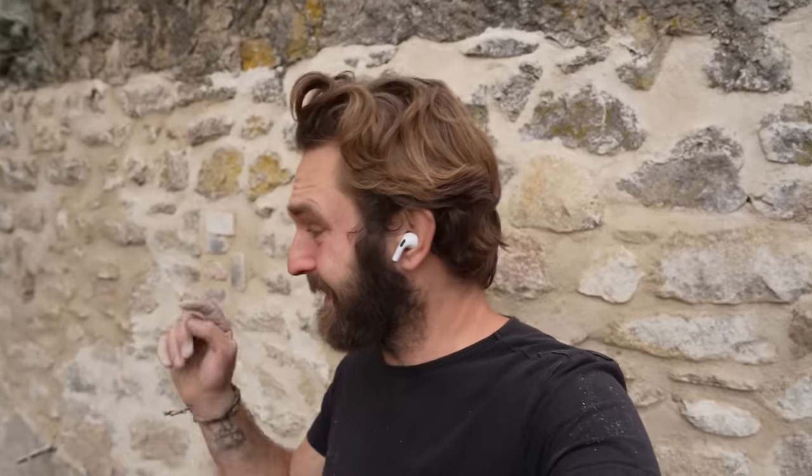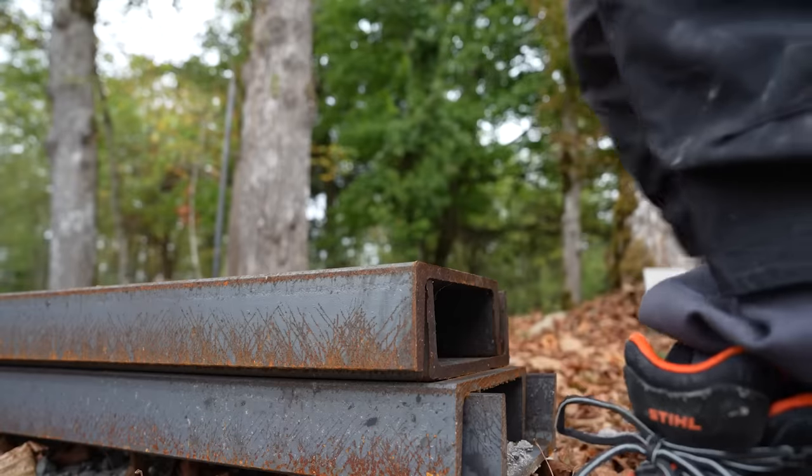So I'm going to get the C section, which is going on here, painted, ready for the install, because we're not going to be able to get behind it. So like the I-beams I can paint after they're in, but the C-section all needs to be painted behind.